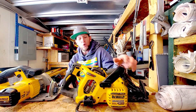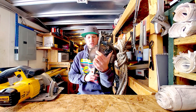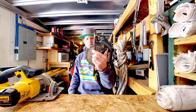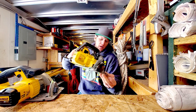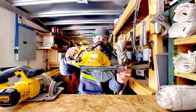Now there's the seven and a quarter inch worm drive style saw. There's only two times when I use this thing, and one of them is when I'm rolling floors. I need the extra depth out of that seven and a quarter blade so I can cut through an I-joist in one pass. If you want to see me going to town with this saw on some floor joists, check my video links below.